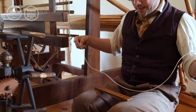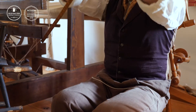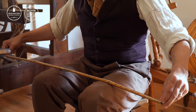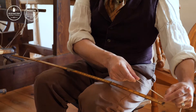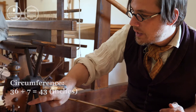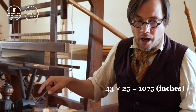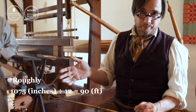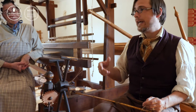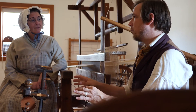Then I measure it with my stick of inches here. I've got 36 inches, which is going to be three feet, which is one yard. I'll stretch that string across it and it looks like we're going to have a full 36 plus another — that's about seven inches. Now if I look at this, there's 25 teeth on that big gear. So if I'm wrapping this around and it's wrapping thread the entire time, it's going to count up 90 feet. And if my math is right, you take 90 divided by 3 to get the yards, and it would be 30 yards.